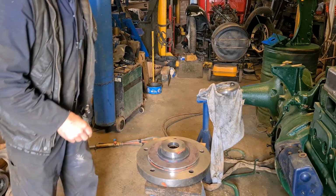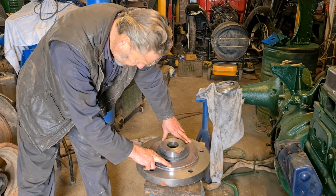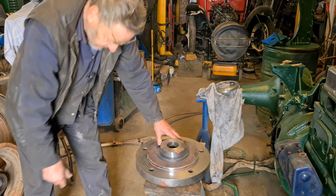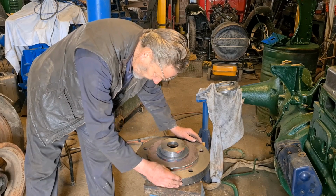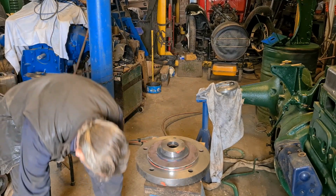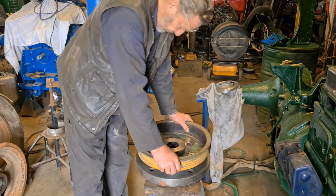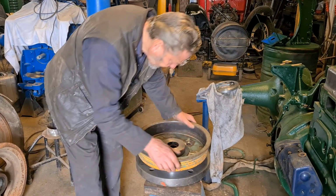Okay then, what we've got now, I've just put my spacer on there, which is a 12mm plate spacer. I sort of wanted 13mm when I measured it. I may need more, but hopefully with the adjustment on the sliding axle and a bit of adjustment on this one, which supports the back plate, I might be able to get it about right. But anyway, that's gone on there. It's still quite warm. Even that's warm. It's surprising how that heat's dissipated all in there. But anyway, that's on. And just to say, I have lightly polished the inside of this with a flat wheel in the drill. It sort of starts and goes a little bit tight. And to be fair, there's only like 2 or 3mm gap in there.